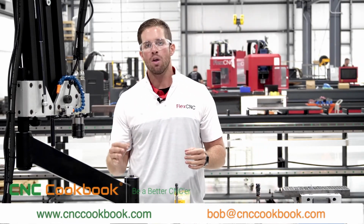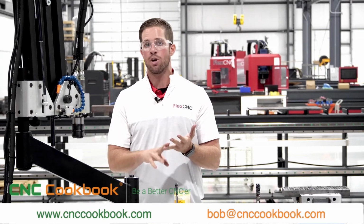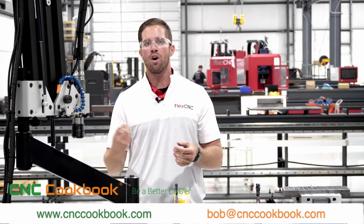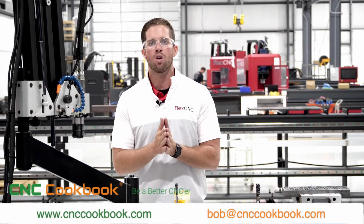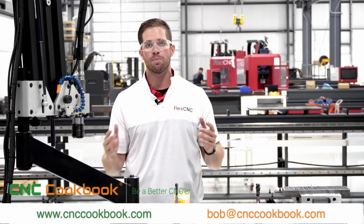We can help you qualify the right solution based on the material that you're going through and the size that you're running. So since we're displacing the material and not cutting the material, the FlexArm requires a little bit more torque. So that's something that we can talk more about if you have an opportunity where you're threading some holes and you want for us to test something out for you.